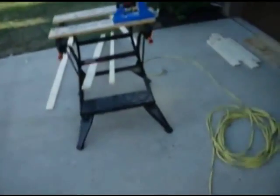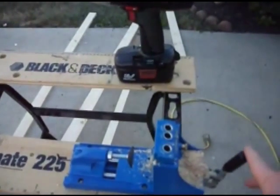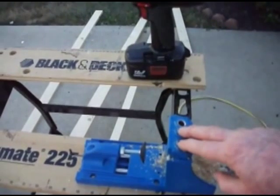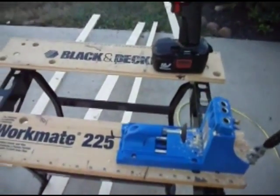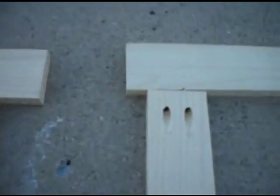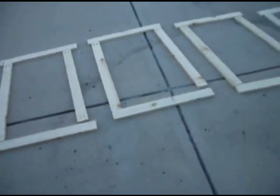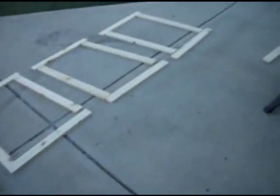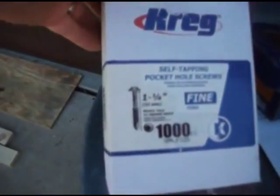What I am using is a Kreg tool. I have got the whole kit over here, and this is the gadget I use right here. You just put the ends of your board that you are going to join into here. You can space it different ways, or you can do all 3. I am using 1 by 3's — so they are 3 quarter inch by 2 and a half. It makes that nice little indent on a 3 quarter inch board, which is what they call a 1 inch but really isn't. You use a 1 and a quarter inch Kreg screw. You can buy these in bulk or in smaller quantities. I buy them in bulk because I do a lot of Kreg assemblies because it is so easy.